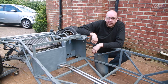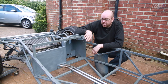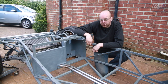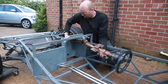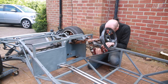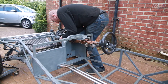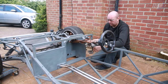Well that was a chore. Despite spending all day going around very carefully trying to avoid distortion in this panel, it's still warped and twisted a bit, which is really frustrating and definitely confirms that I am not very good at welding in panels. I'm glad Chris did all of the stuff on here, because frankly he probably should have done this one. So there's just one more job to do now, which is to refit the steering column — surprisingly difficult when you're on your own, more so because we've enclosed the top of the footwell. We're leaving the pedal box out for the time being and we'll have to remove it again soon when we start looking at the pipework for the brakes, clutch, and fuel lines.